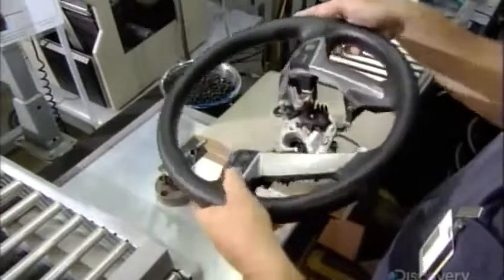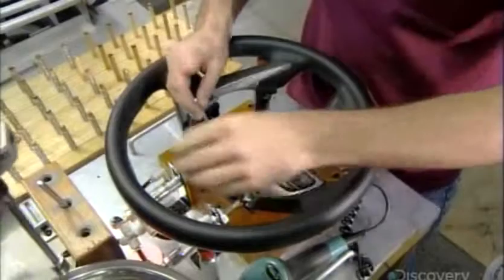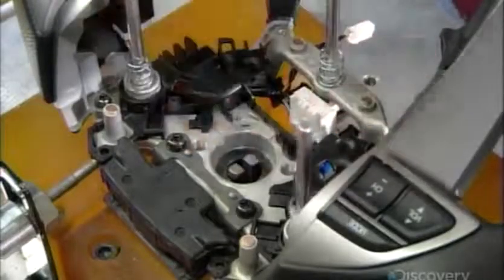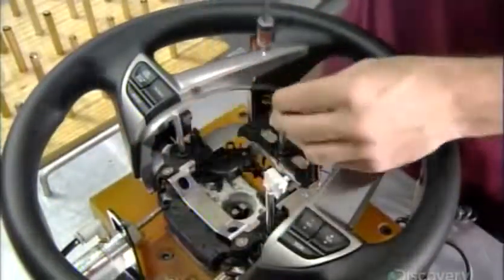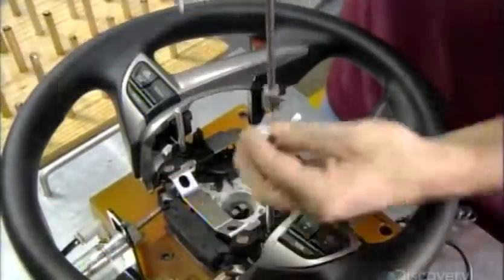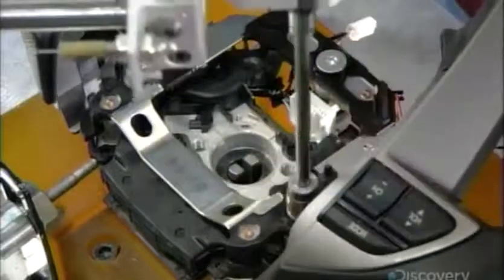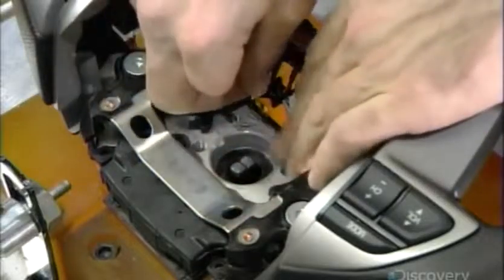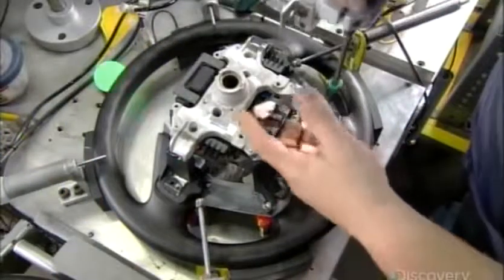After applying a barcode sticker, they route the wiring through the steering wheel to prepare it for final assembly on the automaker's assembly line. Next, they install spring mechanisms that support the airbag module, enabling it to move in and out when you sound the horn. Then they attach the horn plate, to which the carmaker will later attach the driver's side airbag module. They take the ground wire in the wire harness and position it, then flip the steering wheel and secure the switch finishers to the exposed back of the armature.